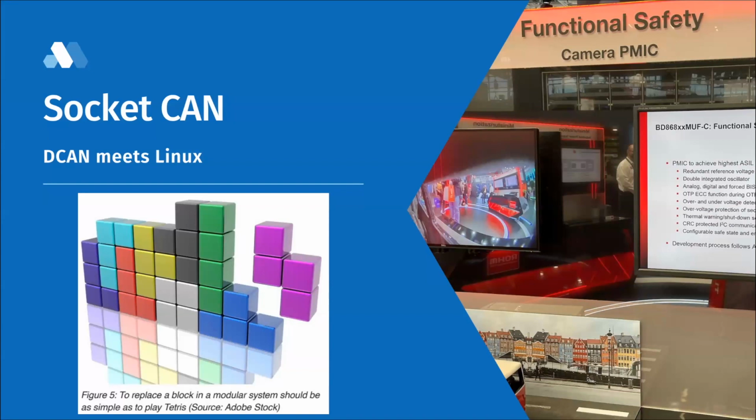And just to mention that the available on-market CAN FD stacks are built upon an existing CAN driver, and they are operating system independent. So the Socket CAN can be easily integrated into them. And so we have this modularity. It can be easily added to another system that already exists.